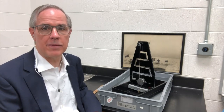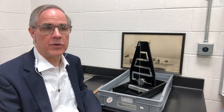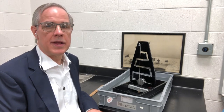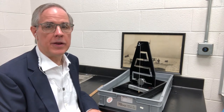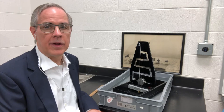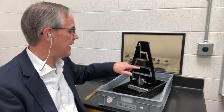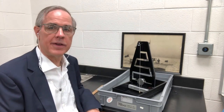The easiest approach, since two out of three methods go from the center of gravity, is to just compute everything from the center of gravity and adjust your analytic result accordingly. We're going to measure using the weight shifting technique, which is the same one the U.S. Navy uses. It's very simple but you have to pay attention to what's going on. The weight is at midships at the center of gravity. Each of these teeth — the gap between the teeth — are 0.75 centimeters apart.